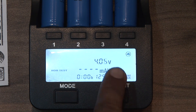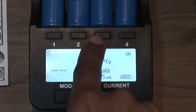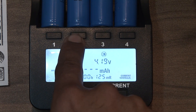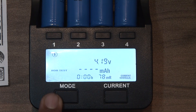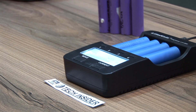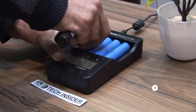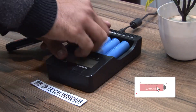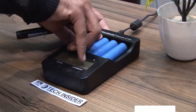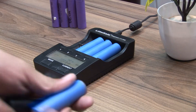In no-test mode, it will charge your battery full, and after it's fully charged the milliamp-hours that your battery has will stay on the screen. In fast-test mode it will discharge your battery from current voltage and test how many milliamp-hours your battery has. I recommend you to write it down on your battery so you can know in the future how many milliamp-hours that battery has.